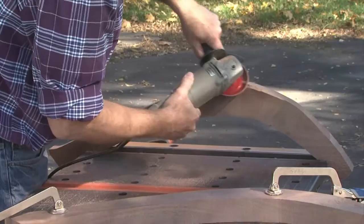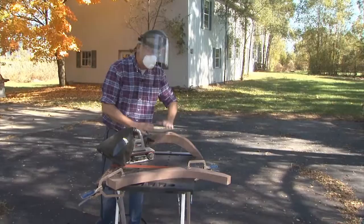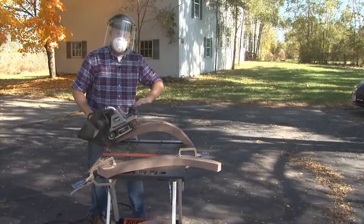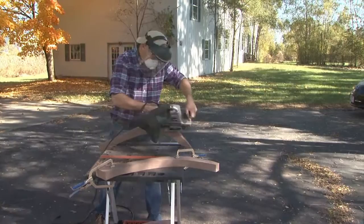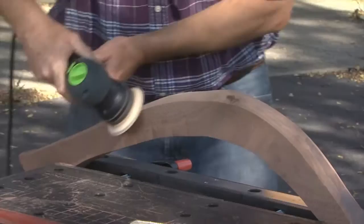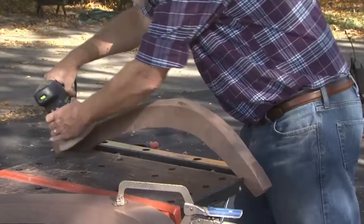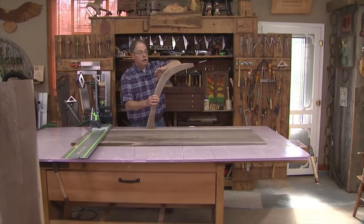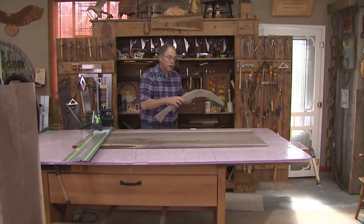After I use the tungsten carbide cutter to break the hard edges here, on the outside of the curve, I can sand it down working with 80 grit, and then use a couple other sanders to profile the legs to perfection. Very soon, this leg will get a shelf that actually helps to hold this assembly all together. The inside is rounded over, the outside retains a crisp or hard line edge. So more on the legs later.